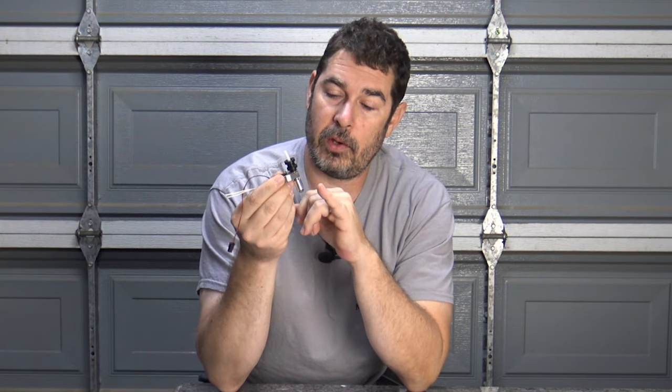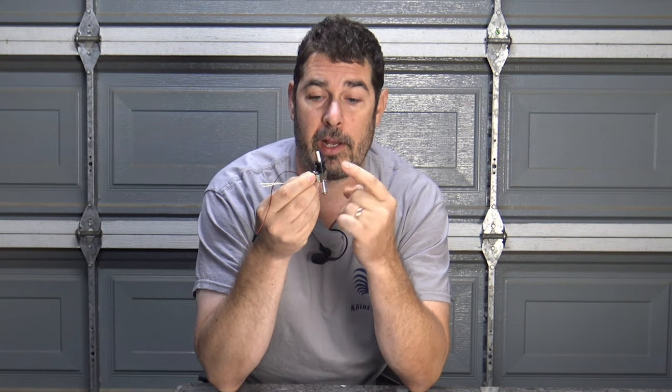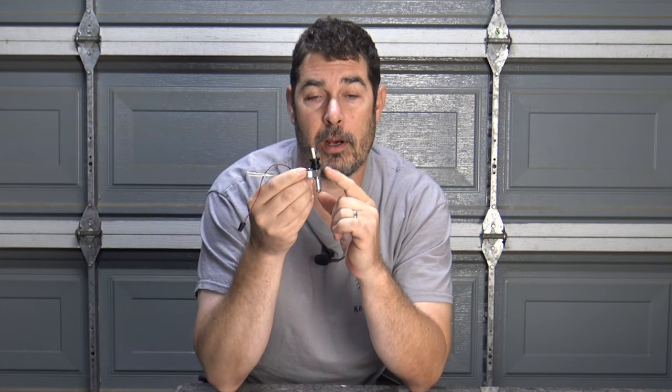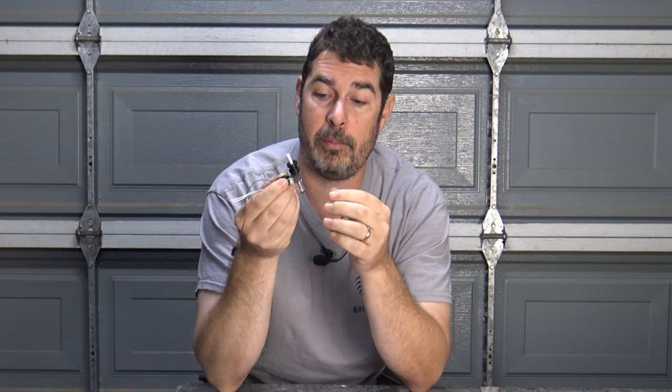Now, aside from that, a couple of the awesome benefits that was touted by this guy is that you could go from all metal to PTFE lined simply by changing the nozzle. Their nozzle has either a cap inside that you can put a PTFE liner in it, or you can run a nozzle that runs all the way up through into the heat break, into the heat sink, if you will, an integrated heat break style, should you need to run hotter materials.